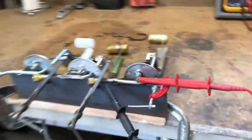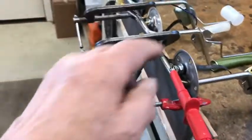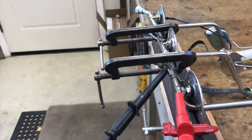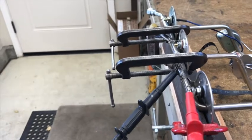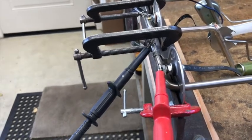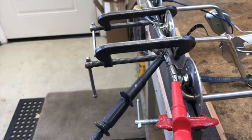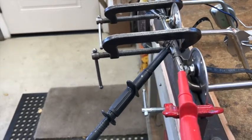I've played with this unit repeatedly because, first of all, the little stud that it came with broke off — it's essentially riveted on a little tiny brass rivet, but it was loose to begin with. When I tightened it, there wasn't enough material there and it came loose. When I peened it over, it kind of made less material even. I went to put the terminal on it and it came off. So I replaced that terminal stud with a 10-32 screw and a nut on the inside, a couple of plumbing washers, a nut on the outside, and you bind the terminal between another nut on the outside. That took care of that.